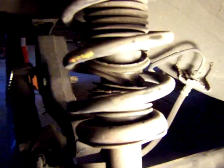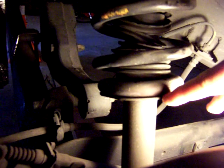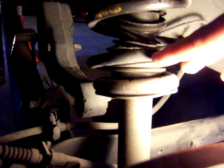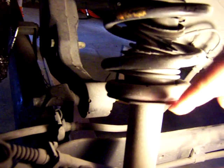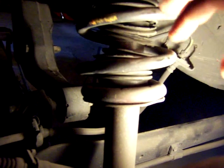I had an idea while working here with the tire removed. These springs are the ones I may need to strengthen. I was thinking that maybe all I need is to have this plate removed and raised a little bit — with that, the spring will push further up. So if I detach this and solder it again a little higher, there's actually a small space there to do that. Maybe I don't need to buy anything else — I just need to move this up.